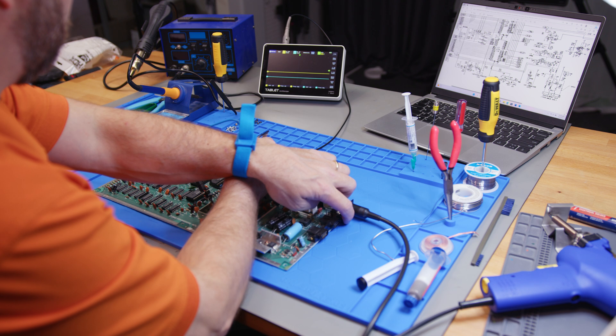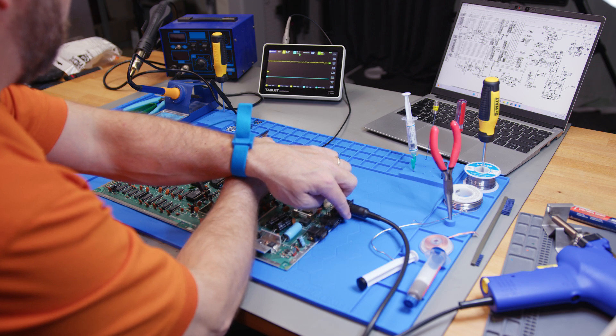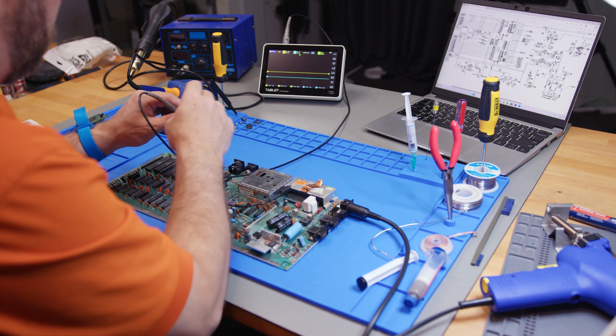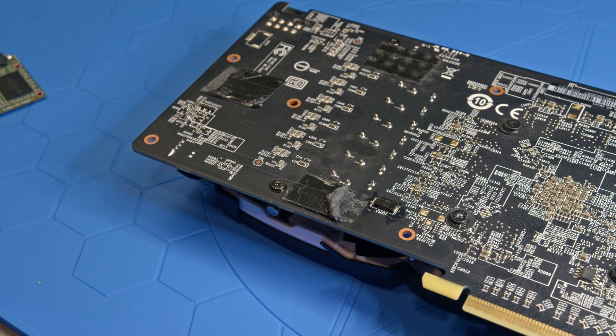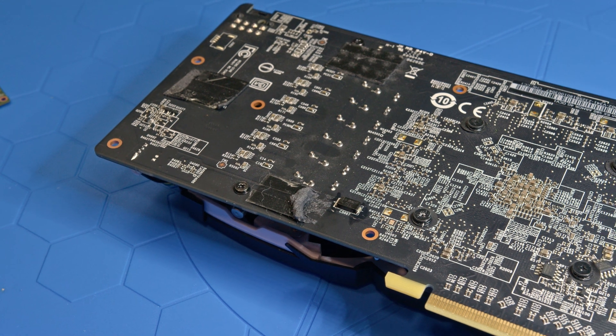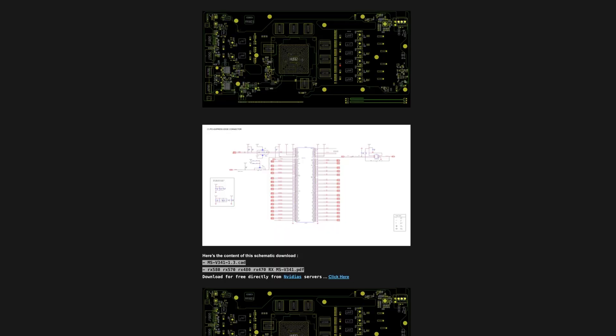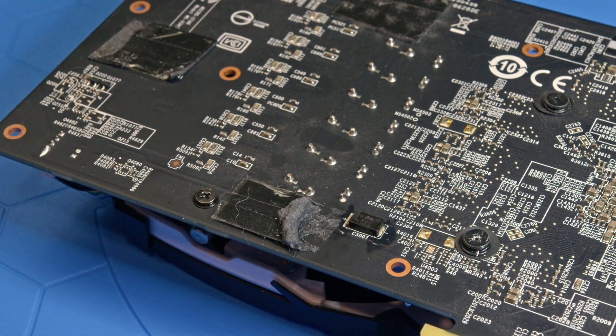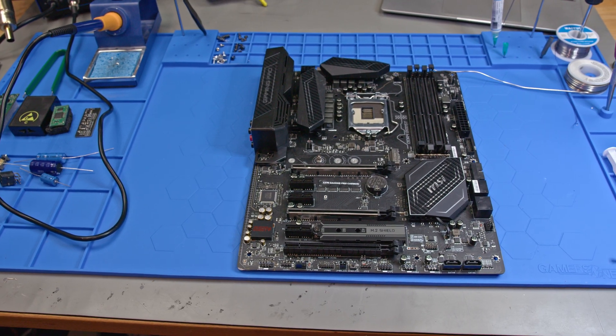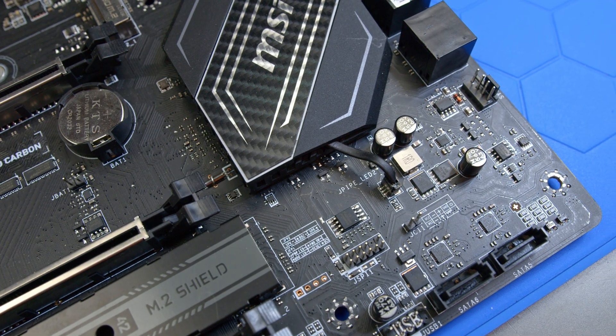Many of you watching might not be familiar with tools like an oscilloscope, but that's not really the point. The main idea is that if you have the skills and tools, you should be able to repair your own equipment. For example, my RX 580 had an issue — someone ripped an SMD off the back of the board. But I was able to find a schematic online, identify the component, order a replacement, and solder it on. Good as new. The problem is, sometimes manufacturers don't make it easy to find schematics or board layouts, like with this bricked MSI motherboard. It's an older model, out of warranty, but even though replacing a ROM chip is a simple task, if I wasn't experienced enough to know which of the several ROM-like chips is the BIOS ROM, I'd be left with a bricked board.